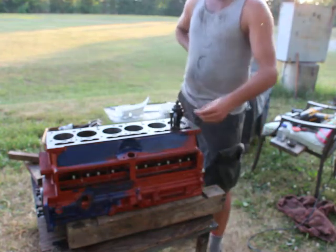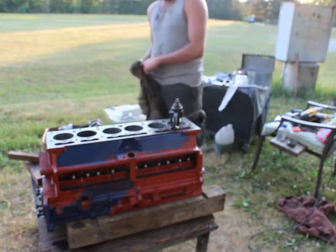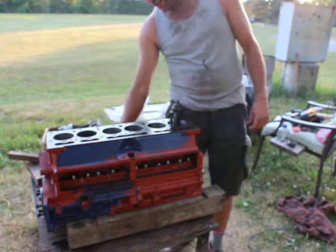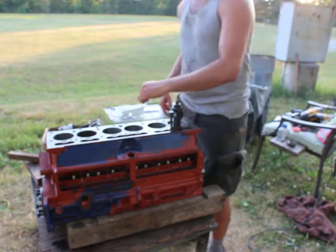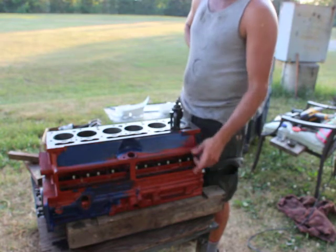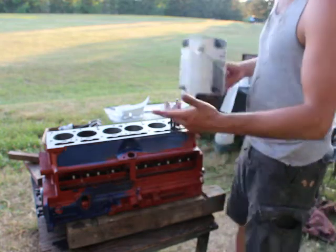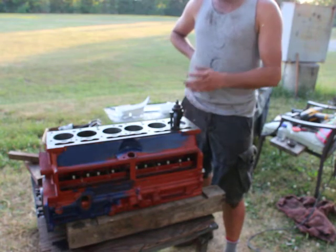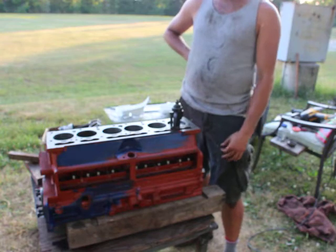The hardest part of this job was actually the lubrication — you're not really supposed to do this dry. I previously tried automatic transmission fluid and oil but didn't have good results. It kept seizing up at some point and then taking off big chunks — deep gouges into the cylinder walls. So I'm now just using coolant or antifreeze. Since this is a pretty old tool, I couldn't really find what exactly is suitable for lubricating it.